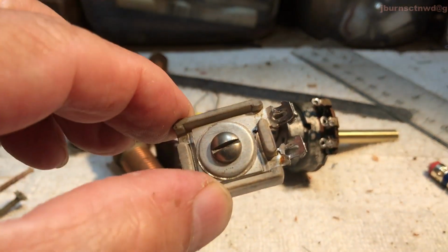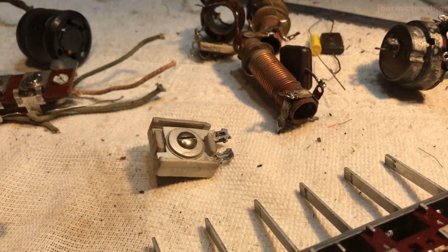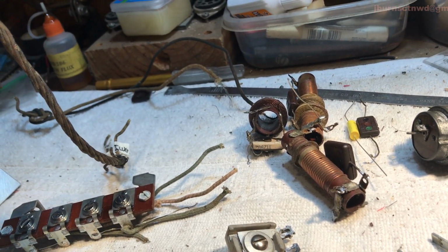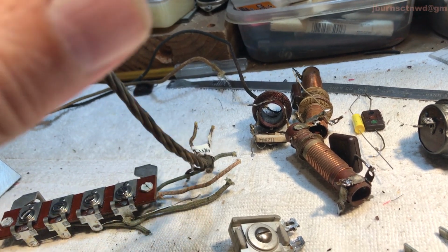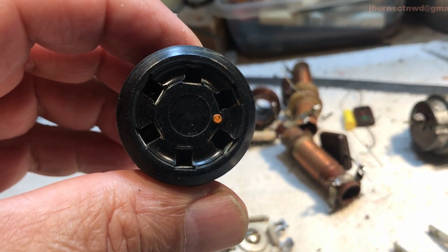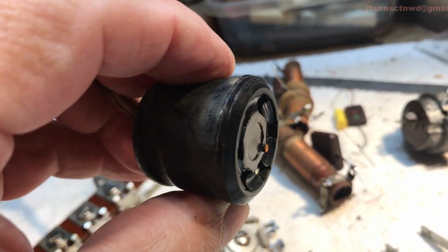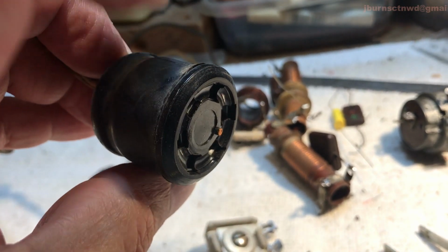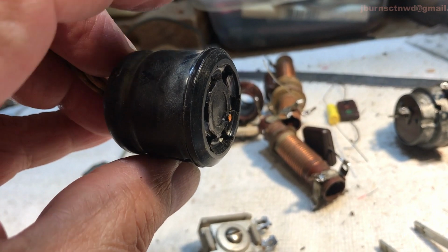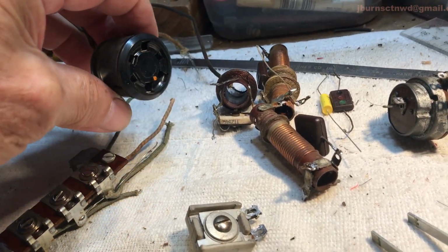The little patter we got cleaned up and turned on. We pulled the socket and the loom for the eye tube, and yes, the 1 meg resistor that's typically with these is in the socket, and I opened it up without breaking the thing, and checked it, and it's right on.